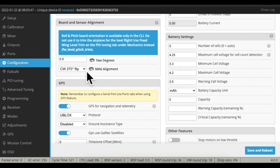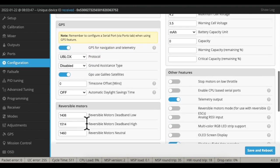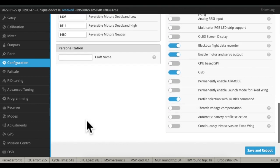The magnetometer alignment we won't know until we turn everything on and see on the goggles. We're going to turn on GPS — it is a U-blox protocol because it's the Beitian 880. I'm going to turn on the GPS Galileo satellites. I'm not going to do too much on the right column; that's all for monitoring, power, and similar settings we don't need yet.